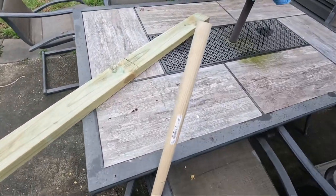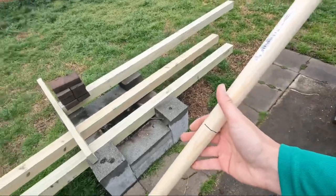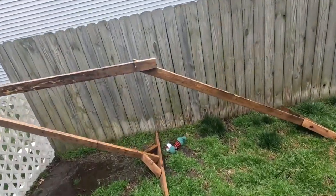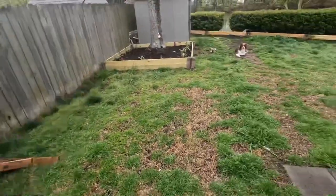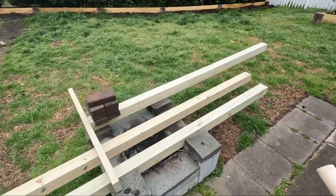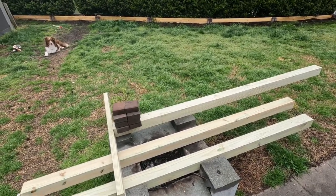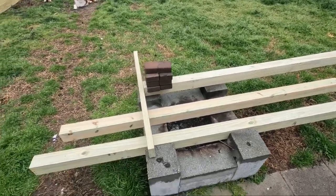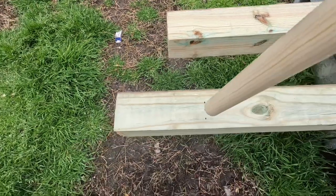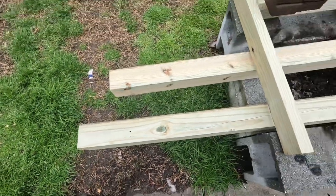The reason we're using a dowel instead of traditional screws is we want a more modern look — we don't want any exposed bolts. If you look at this one over here, you can see the exposed bolts on the outside. You can cover those with flowers, but the idea is we want to use this as an archway when we build out a patio, so we get to keep it forever. Where these holes are marked, we're going to drill in about three inches to glue the dowel in on each side.